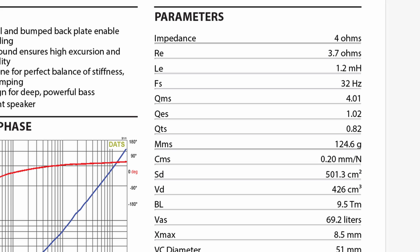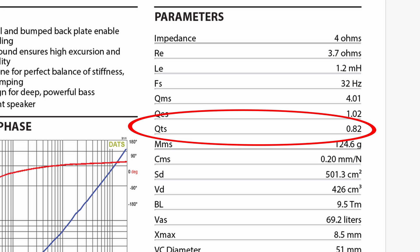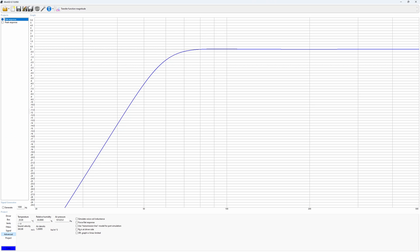A high QTS driver — my favorite. And if you didn't catch it from my tone, I was sarcastic, because this indeed isn't good news. It basically means that the response won't be perfectly flat, but I don't mind a bit of ripple when it comes to a subwoofer. The actual bad part is that we have to build a big box. This is a no-compromise enclosure and making the box bigger doesn't cost much extra, so big box it is.